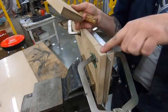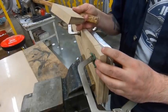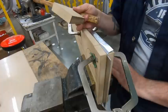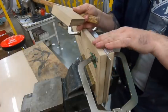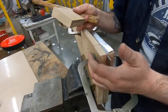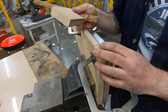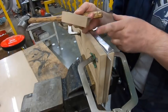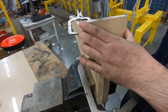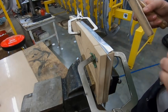Now you'll notice that there's a joggle in here. For the joggles I typically use a little homemade tool that I use in a vise to compress it. But in this case I'm fortunate enough to have the joggle built into the form block, and I can tweak it afterwards if need be. What I'll do is grab another block like this, put a small radius on it, and use it basically as a punch to draw that over where the joggle should be — it'll just help make things easier for later.